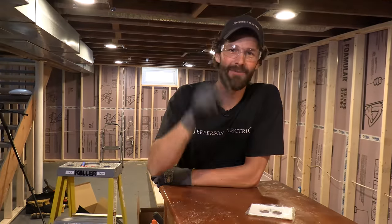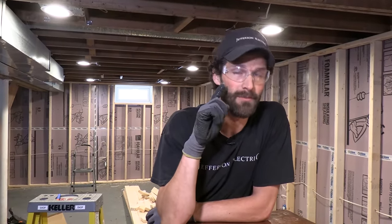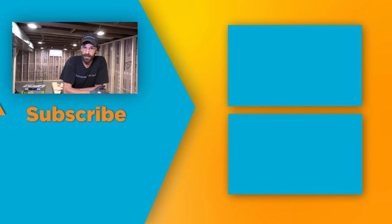A live test — make sure everything works. 124 volts AC, green light says correct. Test everything, double and triple check everything, because we're electricians and what we do is important. There it is. It's a very nice feel to this space at this point. We're leaving the plates off — they'll be placed in an obvious location for the customer to install at a later date. All the receptacles are in — one and done. And it's a wrap. Subscribe to Electric Pro Academy for real skills to make real money.